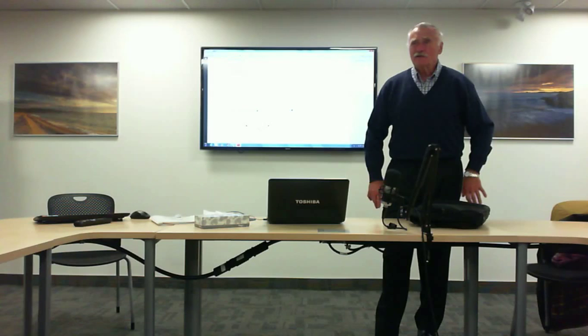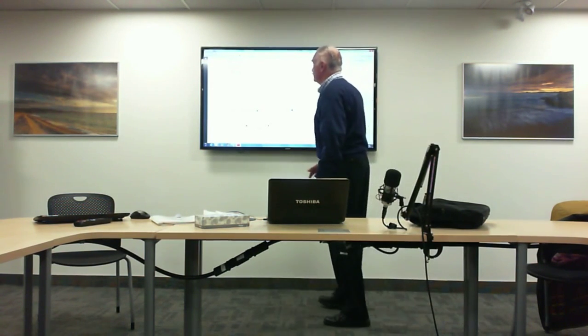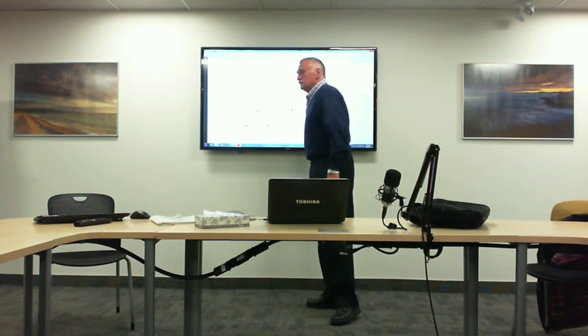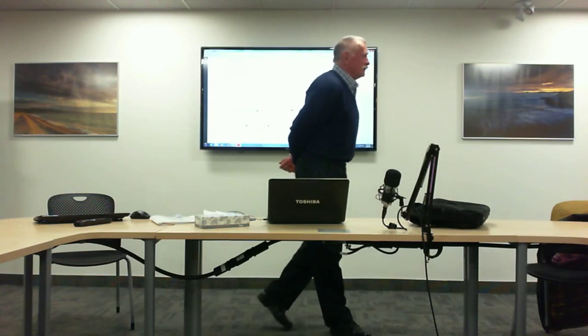We just want to receive a signal that comes in, say, on 10, 20, or 30 megahertz. We want that signal shifted down into a fixed location called the intermediate frequency. So the great invention of Major Armstrong was that the superheterodyne receiver needs a stage called a local oscillator. This local oscillator shall be very stable, to not drift more than a few hertz per megahertz. And this local oscillator must be tunable.